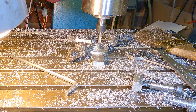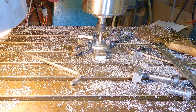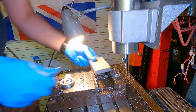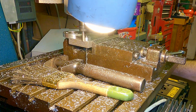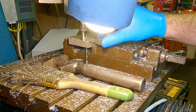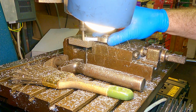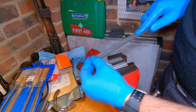And once that's done, I can take the bolt out from the center and mill the extra material left. And using a similar method as before, I'm rounding up the small end of my part. And now I'm just blending in a small imperfection I had in the part.